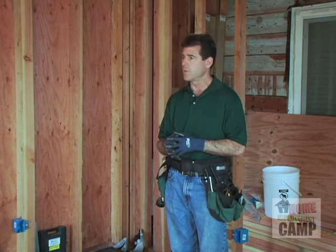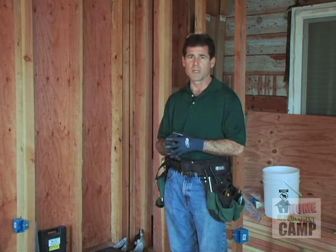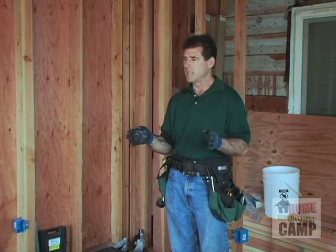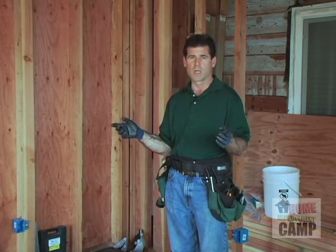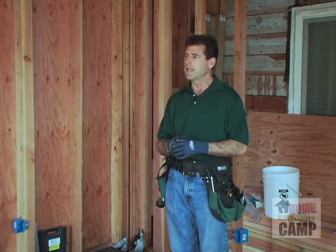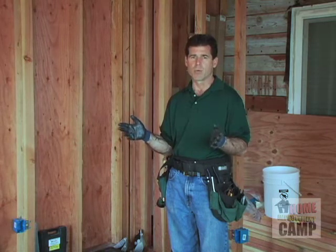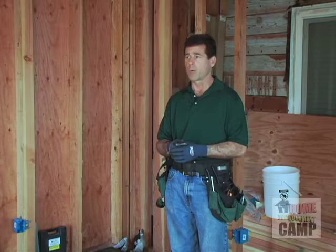We're going to have our audio-visual, our media center on one circuit so we can run all of that equipment. If someone blows a breaker, maybe we have a short in a lamp or an iron or something that someone's using here, or they bring in an electric heater temporarily, we won't trip a breaker that our media center is on. So I think that's going to be really good planning on our part.